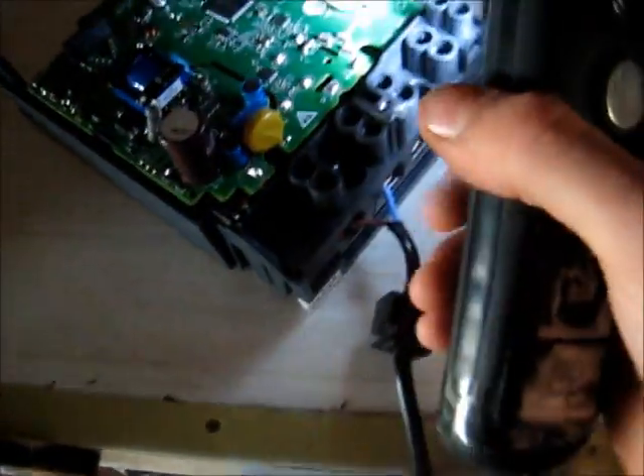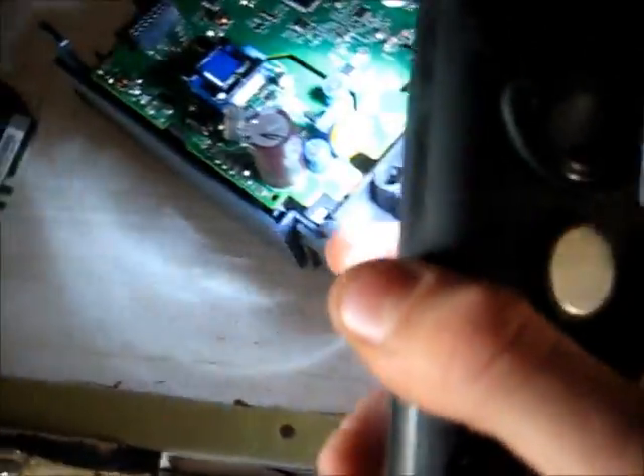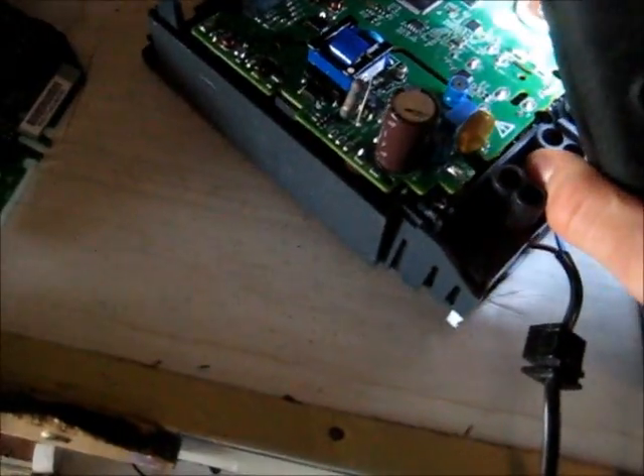Communications port stuff — so that goes to the display board there. Let's get this circuit board out — there are a couple of screws I've got to undo, one under there. We also undid some screws down there, which took the bus bars off the back casing. Undid some clips. The terminal block assembly — which is polyurethane I think — is screwed into the bus bars, which are soldered on through here under the board. This all should slide out as one assembly now.